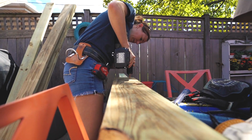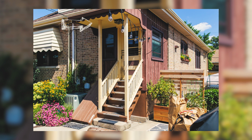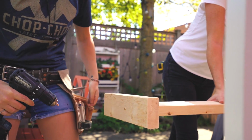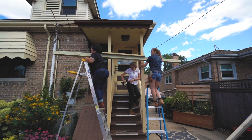So I decided to try more of a support beam header type of holding, where it would span horizontally across the entire awning, then vertical props would be used on either side, therefore pushing them a ways out from the building area. The thing to work around here is to not interfere with the siding, which comes down about an inch on either side of that awning.